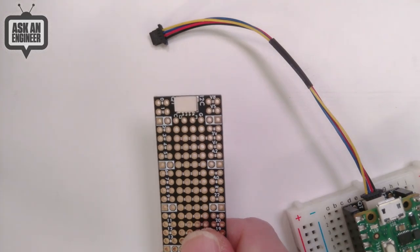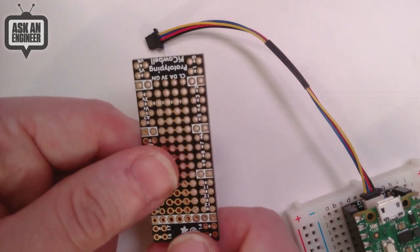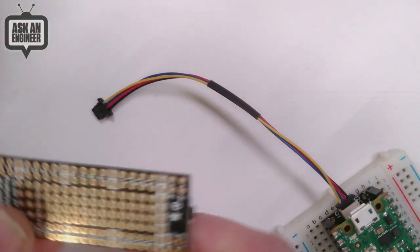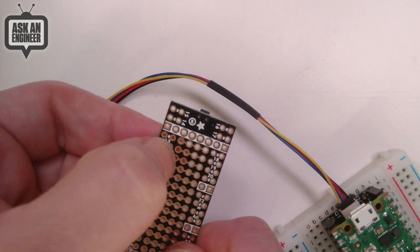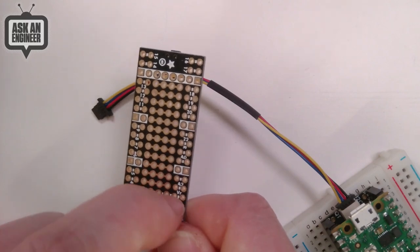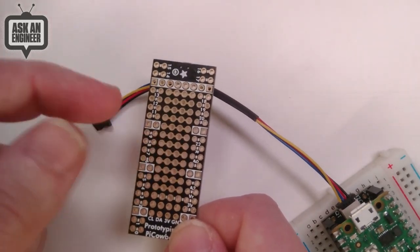The clock and data are connected to pins IO4 and IO5 — that's the default Philhower Arduino core Wire I2C interface. If you're using MicroPython or Circuit Python, pass in 4 and 5 as the initializers for the I2C connection. All ground pins are marked with square white rectangles. Every pin has a duplicate pad next to it so you can jumper to it. The 3 volt line is extended out since you'll likely need a lot of power connections.